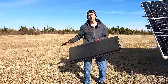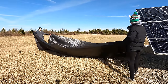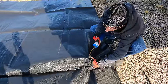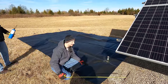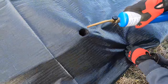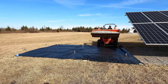I'm going to use this heavy-duty weed block fabric and put it down over the grass before we build the rest of the frame up, then put some gravel on it. That'll help make sure no weeds grow up underneath, which would require a lot of extra maintenance. I had a suggestion in the comments: instead of using a razor to cut an X for these posts, use a torch to burn through it — and that works pretty well. I'm going to bias it to the lower end of the panels a little bit more than last time, because there's plenty of space on the backside to mow, but I don't like getting up close to the edge when mowing. It'll be about three and a half feet past the posts. That torch method was really quick and easy.